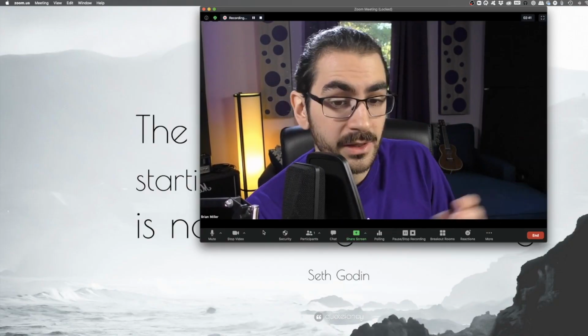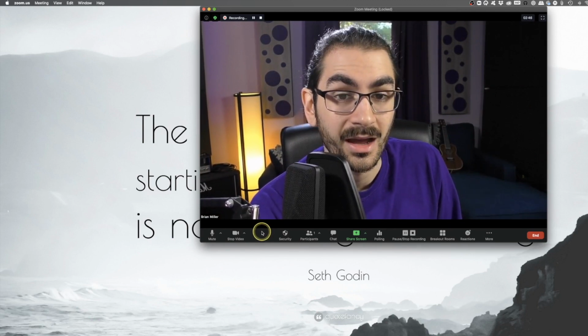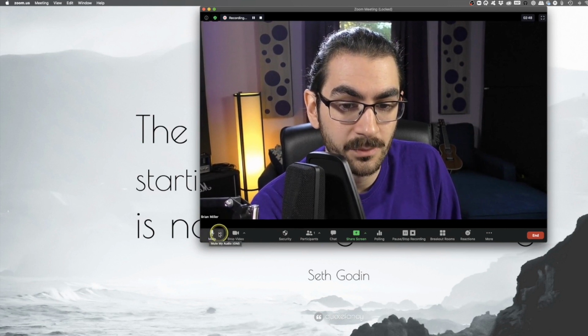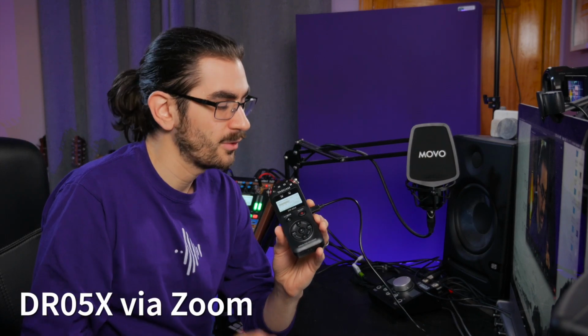Now, at the moment, you're still hearing this microphone because I haven't clicked anything over in the Zoom software. So I'm gonna go right here to the mute button, click the arrow. I'm gonna bring up select a microphone, and under select a microphone, I'm gonna choose Tascam DR series. Now that I've got the Tascam DR series on, you're no longer hearing this. You are actually hearing the DR05X. And in fact, I'm recording this Zoom call. So right now you're seeing my webcam, which is actually a camcorder, and hearing the DR05X. Now the thing is, I've got this set to manual and I'm holding it.